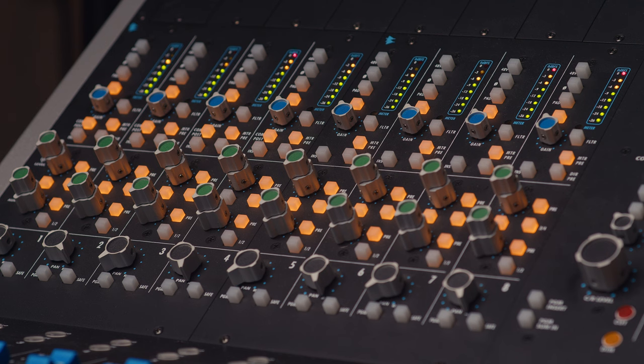Because the Pyra-Sum in itself is a completely passive device. It doesn't need power. It has no sound. There's nothing to it sonically. It's completely clean. The way you get all the color from the Pyra-Sum is by incorporating 8 channels of preamps into it. And that's up to you how you do that. You can do 8 of the same preamps. You can mix and match. Tons of possibilities. So I just want to focus on the sonic potential of incorporating preamps into that and taking it a step further as our baseline.